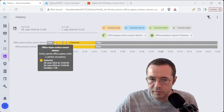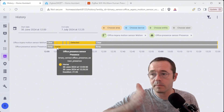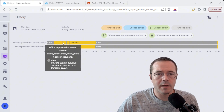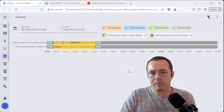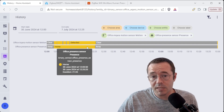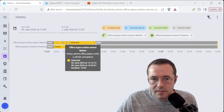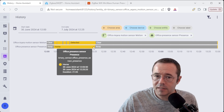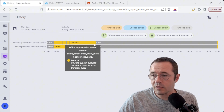This gives you some idea of the sensitivity of the motion sensor and the presence sensor. You can see at 12:03:50, both the motion sensor and presence sensor detected that I was there — pretty snappy. There are little blocks throughout where the motion sensor seems to think I'm not there because I'm either sat or stood fairly still at my desk, and the motion sensor isn't good at recognizing small differences. The presence sensor is millimeter wave, so it detects very small movements and is really good at figuring out that I'm still in the office. And when I left, it was 12:25:47 for the motion sensor and 12:25:25 for the presence sensor — a full 22 seconds longer for the motion sensor to realize I was no longer in the office.